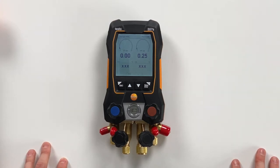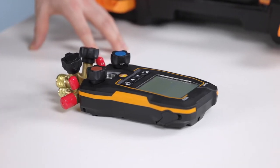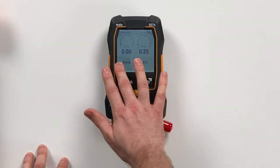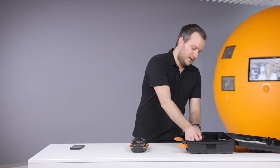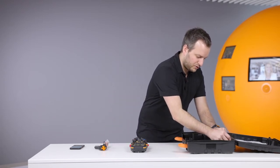This is the basic refrigeration screen. In this screen you can see it's bigger than before. We have the two pressures and we have a big analog display for seeing the values even easier. And then we have the theoretical temperatures. What is missing to do actually a measurement are the real temperature values.